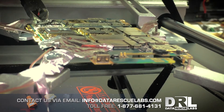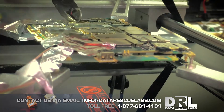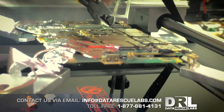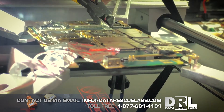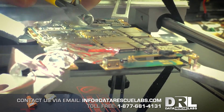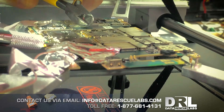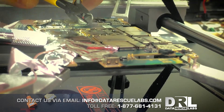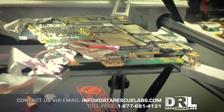At this point we are reaching stage four, so the chip is starting to desolder from the bottom. I'm removing all the other components and testing if I can go underneath. I don't want to force it because forcing the removal might actually damage the chip. I'm just checking the underfill to see if it's flexible enough. Around this spot I noticed my tool was actually sliding underneath the chip, so I'm very slowly and meticulously separating it — not prying.